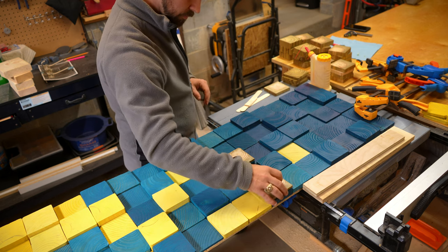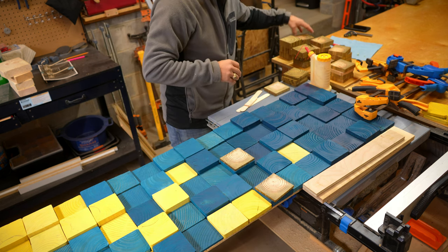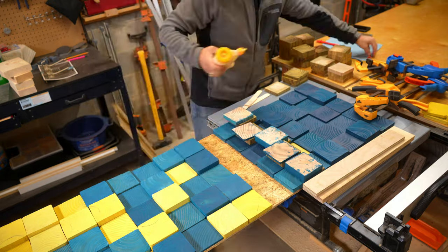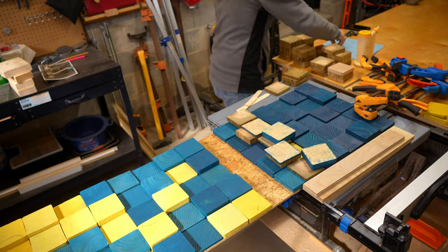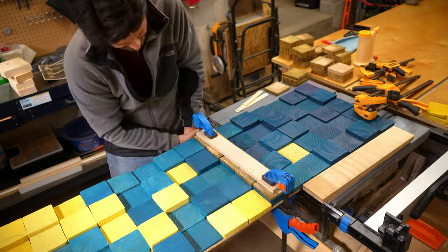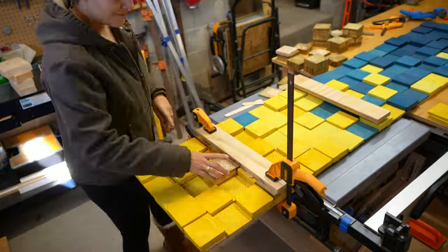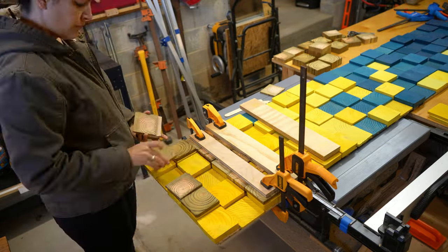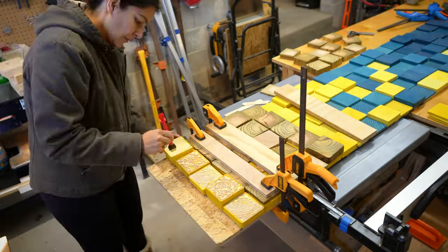The way we attached all the pieces in the center to the OSB was by cutting a bunch of different shims the same height as all the pieces we cut — quarter inch up to one inch in eighth-inch intervals. We would use a combination of these shims across a row to make all the heights exactly the same, so the pieces plus the shim height would be equal across the row. Then you could put a board on top and clamp it down, getting even pressure across all the pieces despite their different heights, ensuring good clamping pressure for a strong glue bond. This was a long and tedious process, giving each row about 30 minutes to an hour to dry before moving on. We thought about using brads or screws from the backside, but were worried about the smaller quarter-inch pieces having the brad or screw go through them. If you have a more time-efficient idea, feel free to leave a comment below.